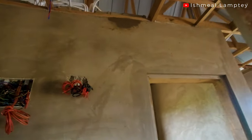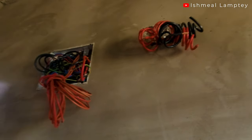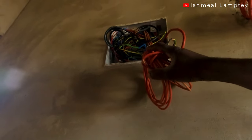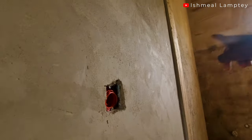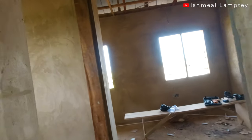In the corridor is where the mains are going to be — this goes to the meter board in the porch. You have the changeover for the solar system here, and this is the main distribution board with all the cables in it. There's one light in the corridor with its switch, which is a three-gang switch controlling the bathroom lights, porch light, and two outside lights. In the bathroom there are two lights and one socket.